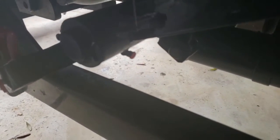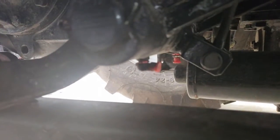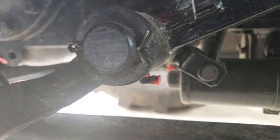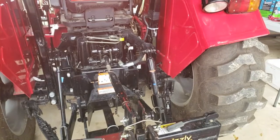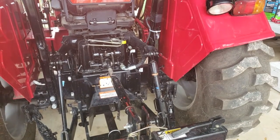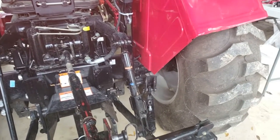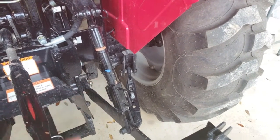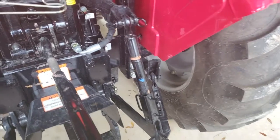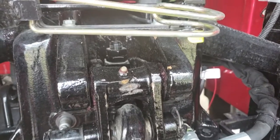Be real careful not to miss that one back there — there are actually two on that post. As you move to the back side of the tractor, we'll call these number nine and ten. Number nine is located on your adjustable linkage arm — you can see I've got a blue cap cover on it. Number ten is your top link Zerk fitting on the top link.